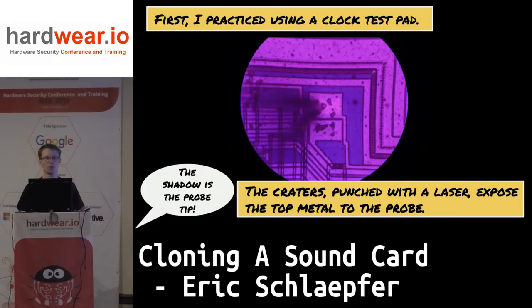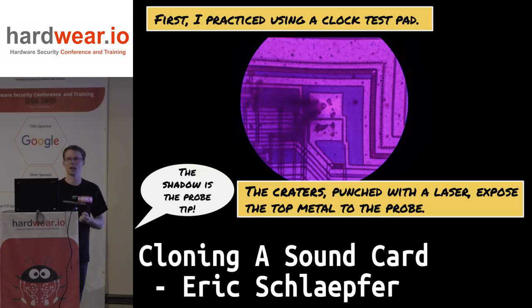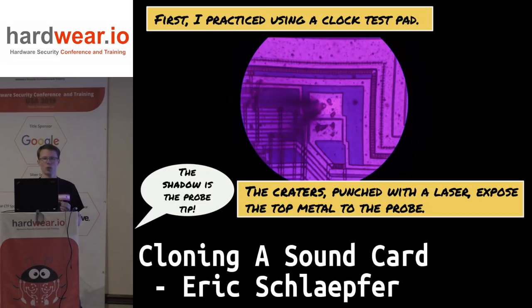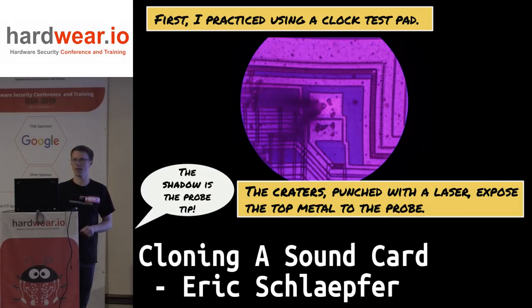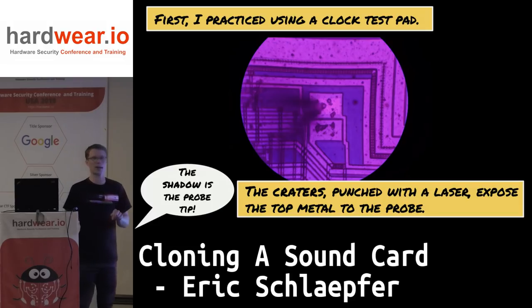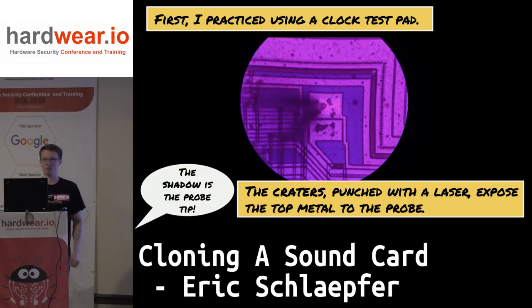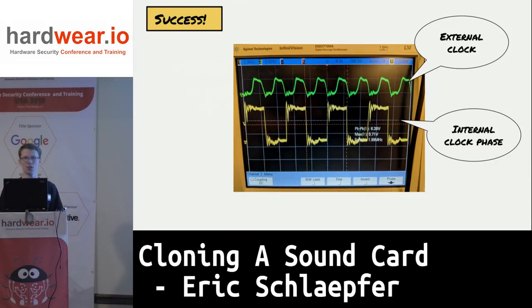As a quick proof of concept, I went in to probe a convenient clock pad — these were put in for some sort of development test, representing two clock phases used throughout the chip. You have to blow a hole through the protective oxide layer first. John's probe station conveniently has a laser installed for that purpose, though his laser is a little old and needs a new flash tube — so sometimes nothing would happen, sometimes it would blow a tiny crater, and other times it would blow a giant gaping wound into the chip.